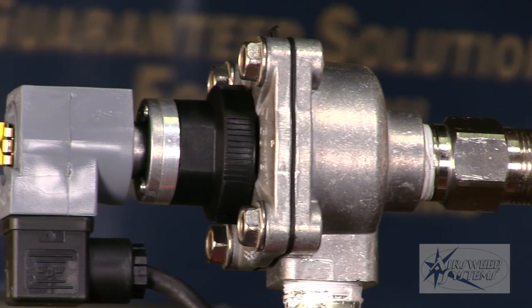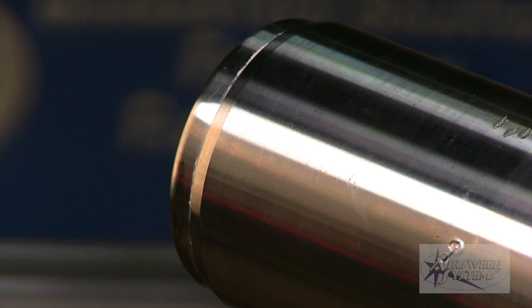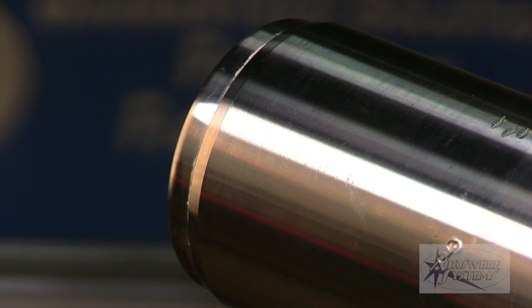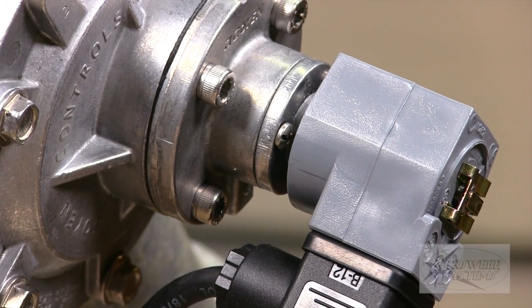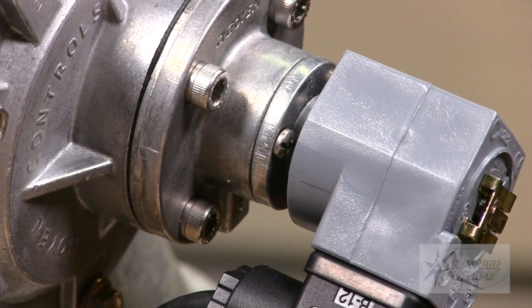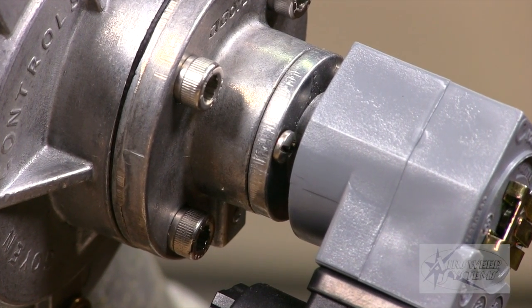When the electrical solenoid is activated, the valve instantly opens and releases a high-volume pulse of pressurized air or gas, which is then dispersed by the AirSweep nozzle into the vessel to promote material flow. After many pulses in what may be hot, dirty, dusty, or corrosive environments, inspection and parts change-out is required on a regular schedule to keep them running properly.